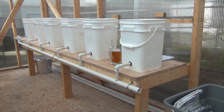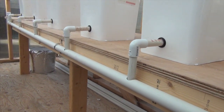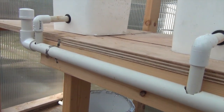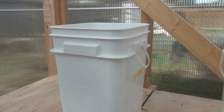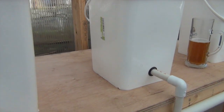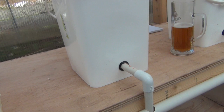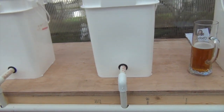That's all installed. After drilling my holes in the top of the one-inch pipe, I've cut various lengths of half-inch tubing to make that 90 and then down into the pipe. The one-inch is on a gradual incline back to the back, just to keep everything going. I've got a little cleanout in back because last year I found it's really nice if you can blast a hose through there — stuff happens, and I had root problems. It's just a 90 right there — comes in and goes straight down into the bottom of the bucket, and that's enough relief for the water to drain out.